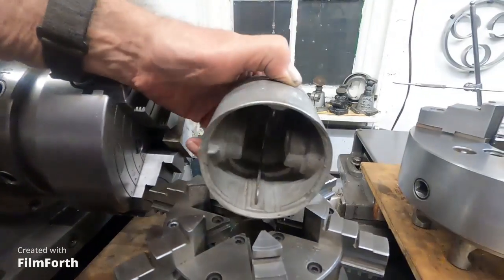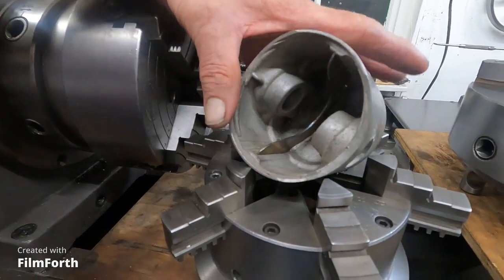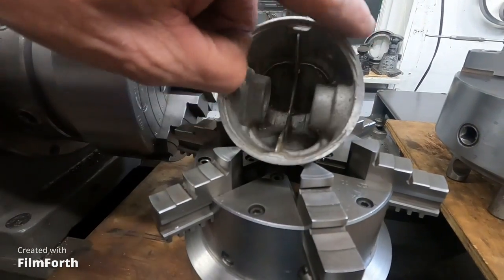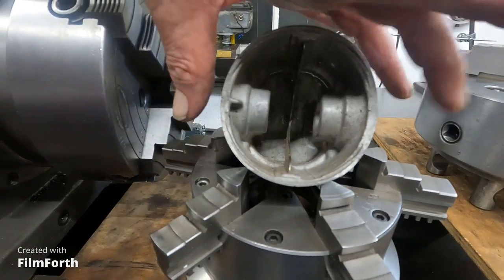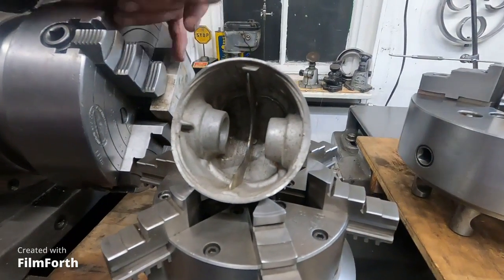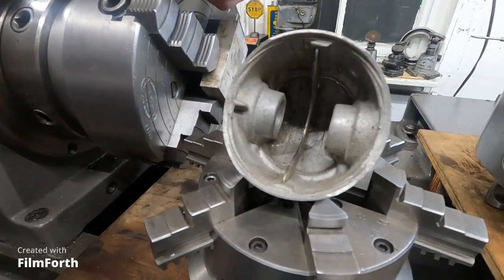This part is not round right here — this is oval. Years ago when they designed this, they put a steel strut in here, so this part's oval. When you fit this piston, the clearance was one to two thousandths right there, but the sides expand and fill in the gaps. When they expand, this contracts — weirdest thing. They did it from 1948 to about 1984 or so, somewhere at the very last Shovelhead. I can't remember, I'm getting old.